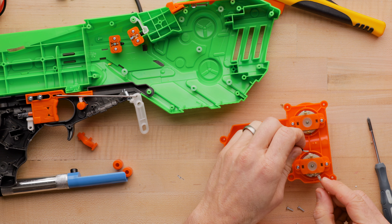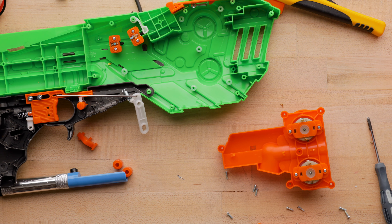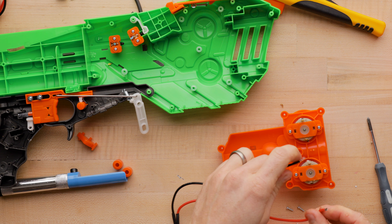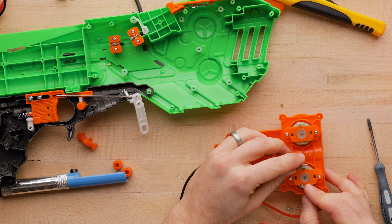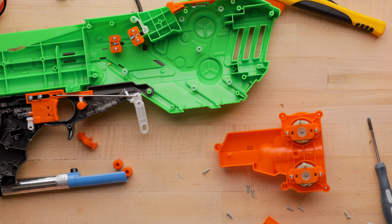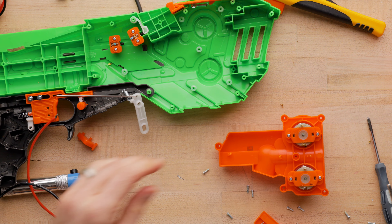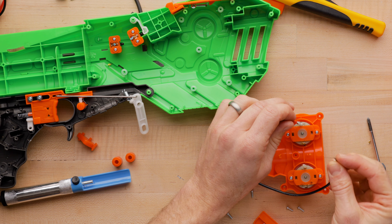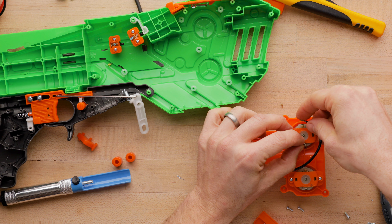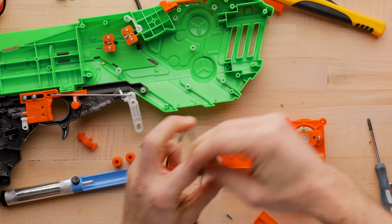I've got a little test circuit here. I'm just connecting a single AA to see — a single AA is not enough current or voltage to get this to actually spin, so I'll quickly tap a 2S on here. There's nothing worse than wiring something up and then realizing you've got it wrong. I like to mark the positive. I'm going to assume the motors are a mirror image, but you never know — they could flip these either way. Positive is the inside there.